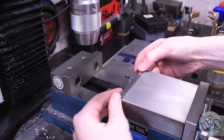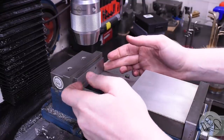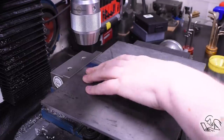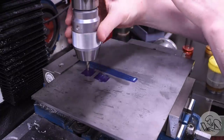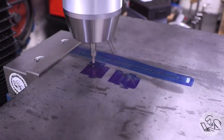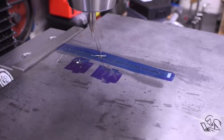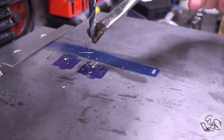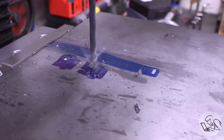Now we need a bunch of holes and I've still got the vise jaw flipped so this will work well. I set up an adjustable parallel the same height as the movable jaw on the vise, which gives me support against the fixed jaw for drilling so I want both ends to be well supported against down forces. I'll clamp that plate directly in there and conveniently where these holes are going to go lines up with the open area on the vise, so I can drill straight through without setting up sacrificial parallels. I lined up the first hole just by eye with the center drill, and for the other one I'll use the DRO dimensions from my paper template, spot drill both of those, then drill these through the clearance size for the bolts — the saw mounting bolts are M6, so this is the clearance drill for that.